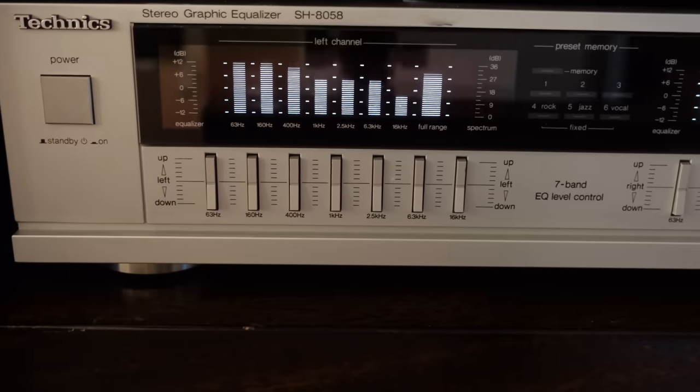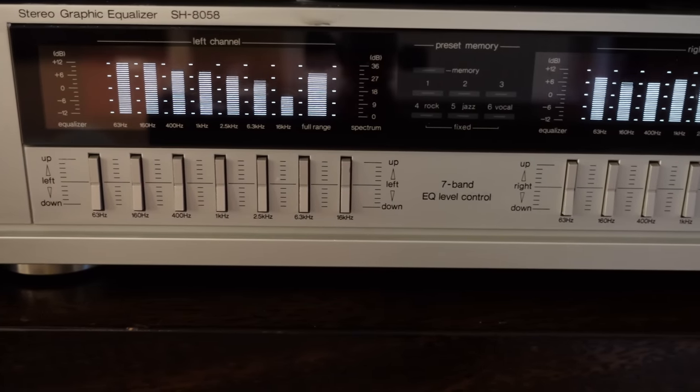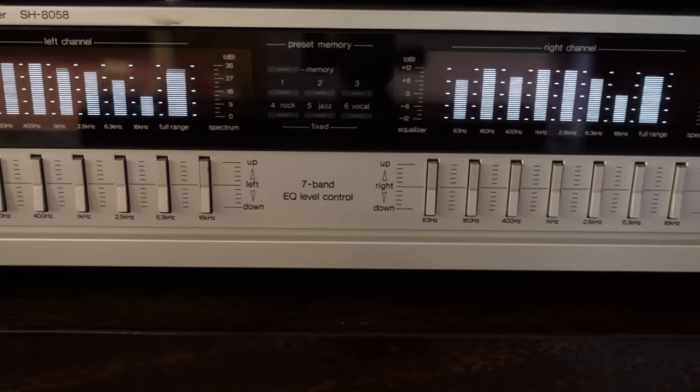Okay, so with this, I've now got the last piece of the jigsaw. I can finally play the audio back as it was intended in mono. Now, the reason it's best to listen in mono is because if you don't, you could get weird off-putting phantom stereo effects, like clicks that were only heard through one speaker, for example.